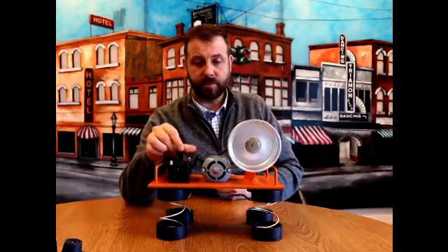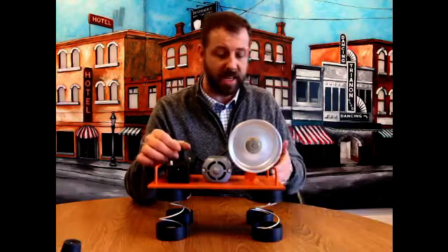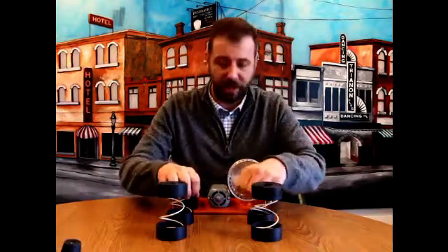When we turn this on to high, there's much less vibration in the table. I can still feel it but quite a bit less than before, so you're getting pretty good vibration isolation. If this thing wasn't so imbalanced you'd probably knock it out almost completely. As we drop the speed, we're still going to drop the isolation efficiency and come closer to the natural frequency of these springs. Now I'm getting close, but I've had to go quite a bit lower — almost to the point where the fan stops. Now we're pretty much at the natural frequency and it's bouncing all over the place. The fan is barely spinning — it's a very low frequency we've set it to, and we're getting maybe half an inch of deflection at best.